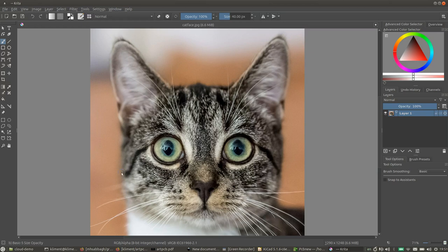So what I want is I want the shape of the board to be the shape of her face, and I want these yellowy bits over here to be gold on the circuit board, and I want the eyes here, the yellowy bits of the eyes, to be the fiberglass color, the beige color on the circuit board, and to be translucent so we can backlight them. And for the rest of the board, I want these white lines here to be white silkscreen on black solder mask. And the fuzzy bits around the ears, we're going to do in halftone. So there's a lot of techniques in here. You don't have to use all of them. This is just an example of some of the most advanced things you can do.